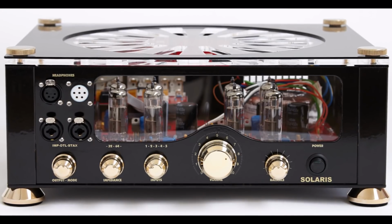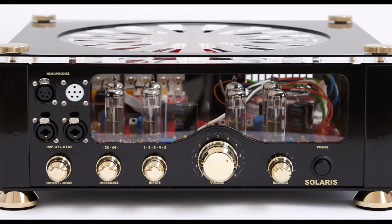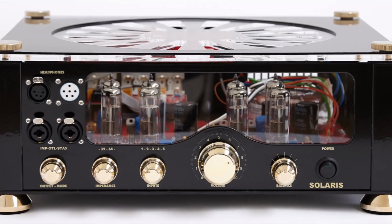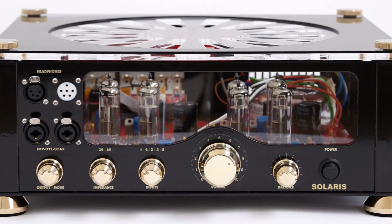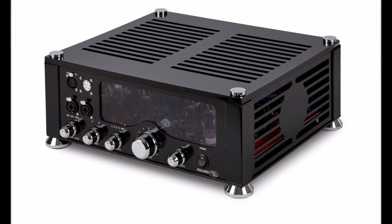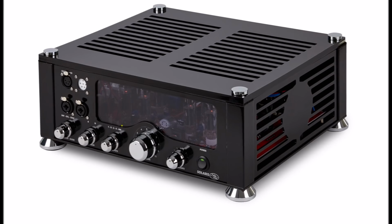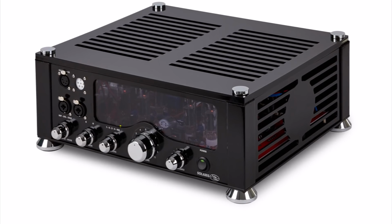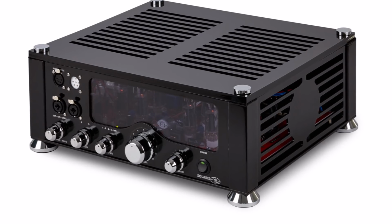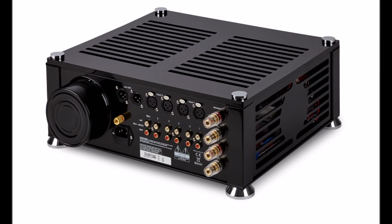The music is supplied in CD resolution from the computer via the USB converter. This converter was developed by Manfred Penning for the Solaris and the RKV3 and the luminaire and can be retrofitted in case of doubt. It accepts PCM and DSD data in all common resolutions. When installed, it is located on input 4 of the Solaris. This input is automatically switched from analog to digital as soon as 5 volts arrive via the USB cable from the connected computer. Cleverly solved. Incidentally, the converter accepts the data exclusively via USB, there is no SPDIF input.